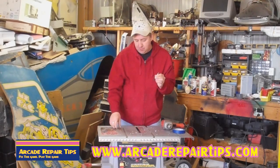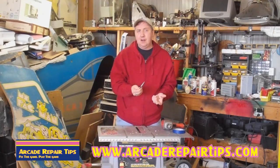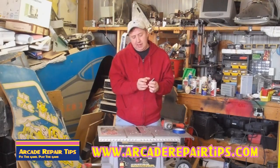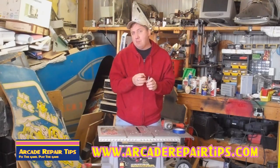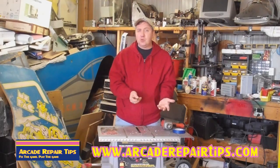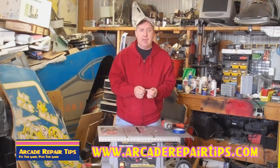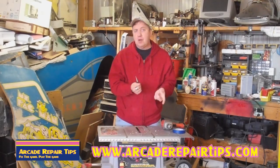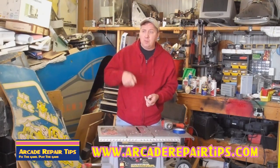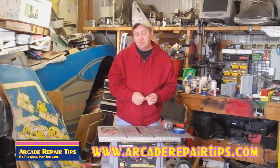The step drill bit is a little bit more expensive — probably as much as a set of regular bits. But if you look online you can find some good deals, and of course you get kind of what you pay for. This one right here was about $18. The one I want to get is a little bit wider, because this one's good for joystick holes, but we really need a bigger one to do the buttons. You've seen us use a hole saw for buttons before, and even that has cracked plexi several times — you have to be really careful. A bigger step drill bit takes care of that. You could actually drill the plexi and the control panel piece of wood at the same time, drilling both holes at once.